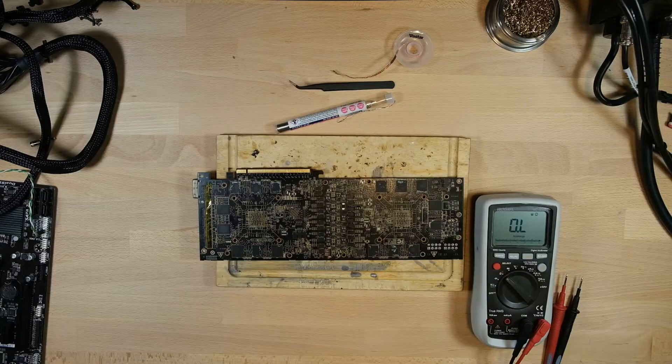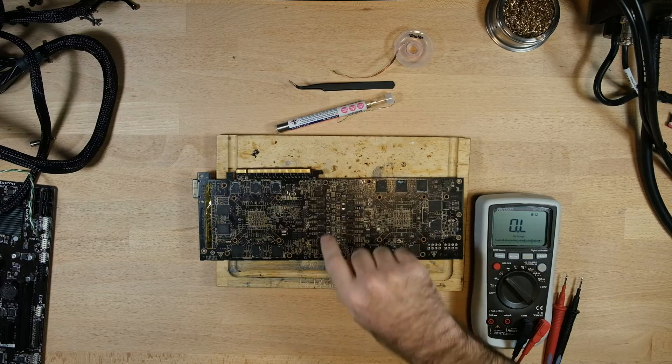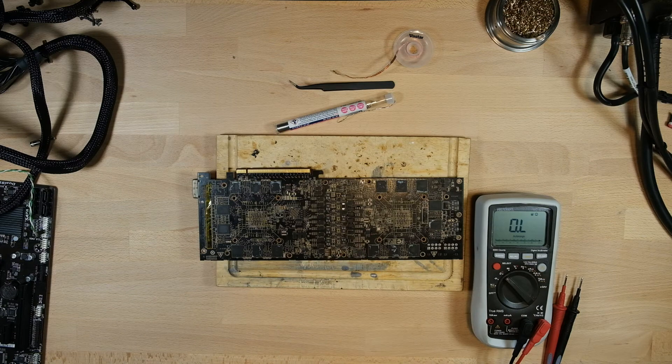You wouldn't have 12 volts if you had a short to ground like that, and that would cause nothing to power up. If we flip the card over, we can see here where we removed that capacitor. We had to stop at that point because I didn't have a replacement capacitor to solder in its place. I now have those replacement capacitors and we're ready to solder this onto the board and test the card — fingers crossed — to see if that's fixed our problem. We need to clean up the pads, get the remains of the lead-free solder and any remains of the leads from the old capacitor off, and get the pads nice and clean and tinned with our new leaded solder, which is much easier to work with. I'm going to go ahead and fire up my soldering station and let that warm up.